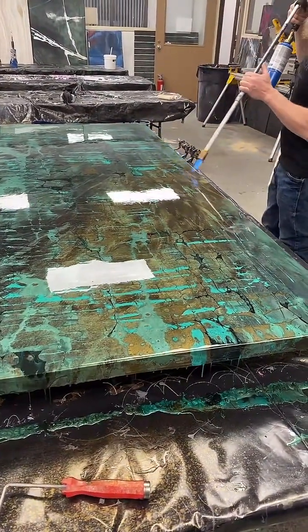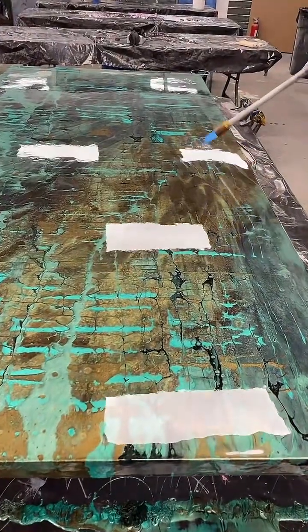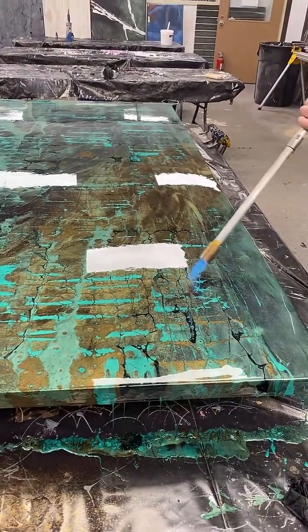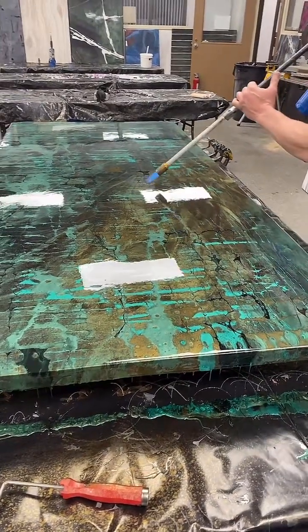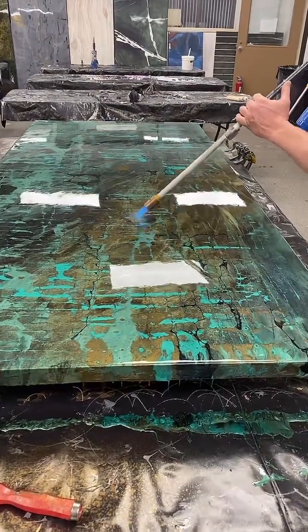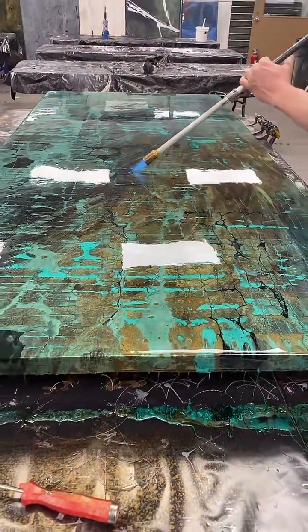Yep, and as you noticed, I didn't over torch it at first because I didn't want too much heat on it until I finished manipulating it, because that'll really extend the cure down to where you don't have any working time. So you can add a whole lot of heat later on in the process, and it'll be a whole lot safer than sooner, because that'll buy you work time. Once you add heat, usually if you're careful with it, like I'm being, it'll really soften this material up and still help it flow and do whatever you need to.